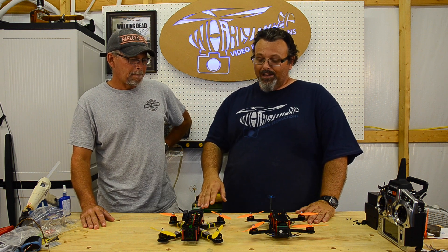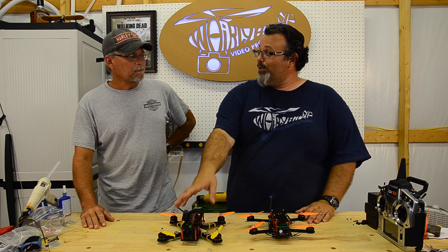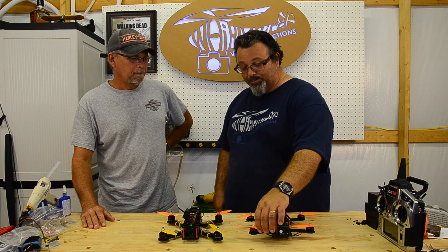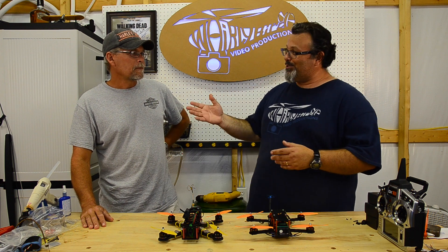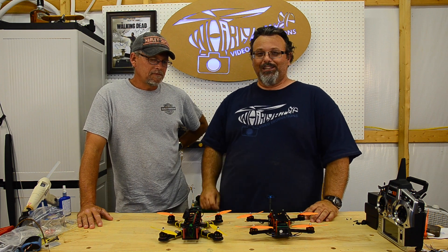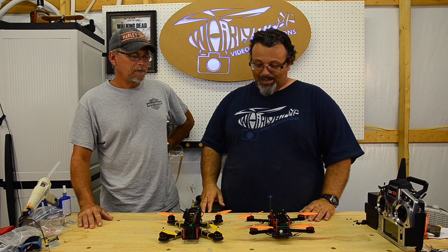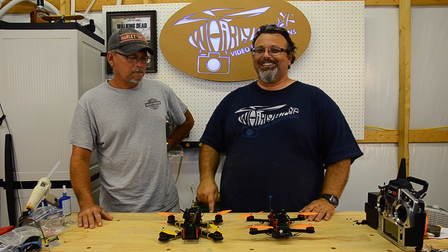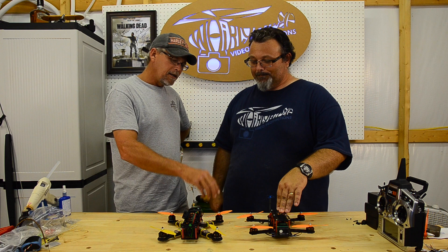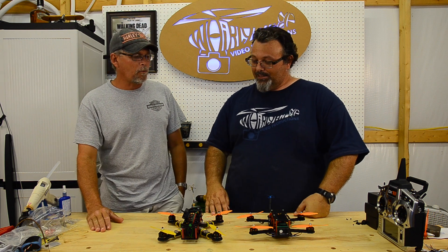This is the Flip 1.5 board, also using Paul's motors from Ready to Fly Quads. These are 2204, 2300KV motors. The X-Hover has the same specs but uses Sunny Sky motors. I was worried my $500 quad wouldn't have as much power as my $150 quad, but I was surprised - the little motors had good power. This is actually the second set of Sunny Skies on this frame. I think it's because the can is about the same size where the magnet structure is - the motors are pretty close to the same size, which is why they pair well with each other.